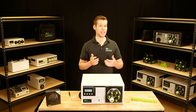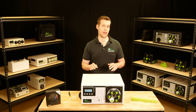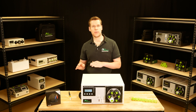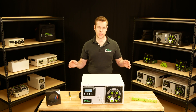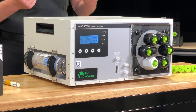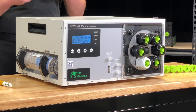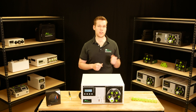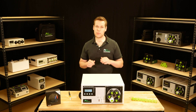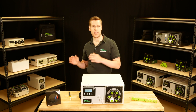Speed is a major highlight — the first thing I hear at trade shows is that this unit is the fastest anyone has ever seen. You can see how easy it is to enter set points, and in most cases, once you enter those points, the chamber will settle on them in 10 minutes or less. At 23 degrees Celsius, this unit can start at 5% RH and settle at 95% RH in less than three minutes. It can perform a five-point temperature cal when cooling from 25 to 15 degrees Celsius in less than 40 minutes. This chamber is so fast and easy that your only concern will be the settling time of the humidity device you're calibrating.